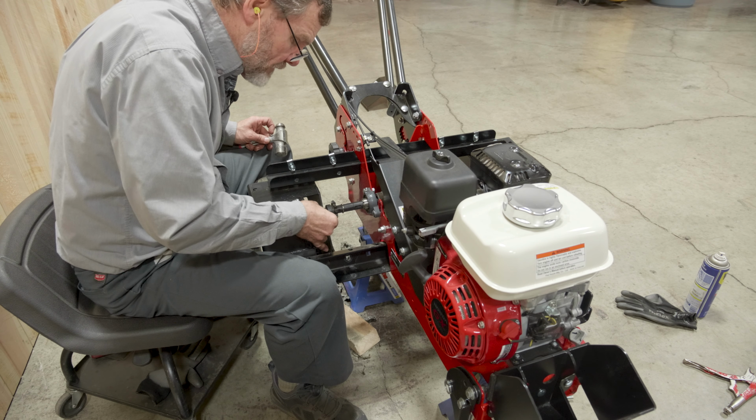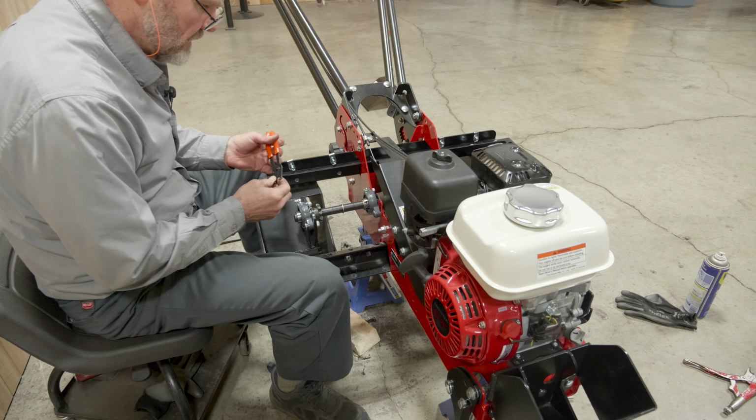And if we can, the leading edge that goes where the sprocket goes into, if we can get that just a little bit, yeah, there, where it seats into that groove, then we can use the actual sprocket to tap that in the rest of the way. We don't want to tap hard. There we go. And we just want to seat it against our C-clip. And we bring the inner C-clip into position.